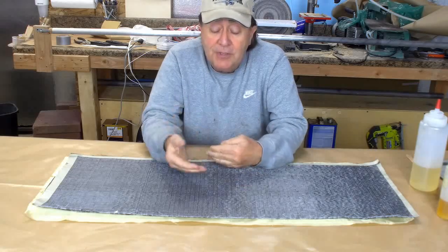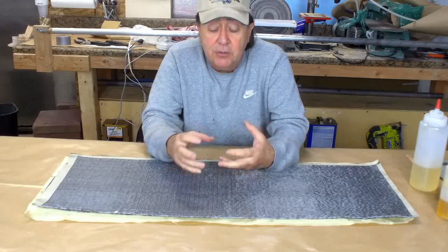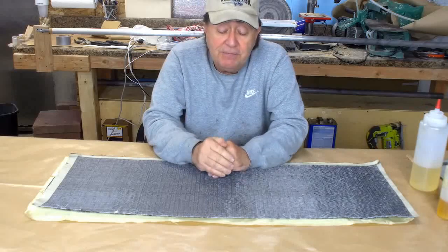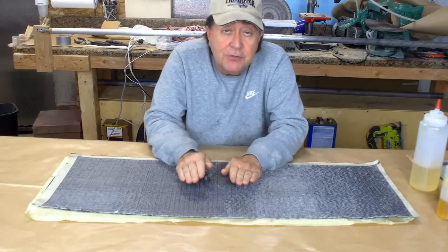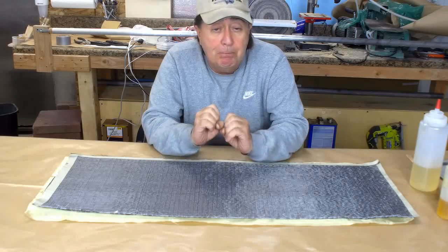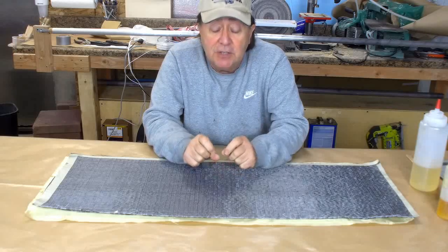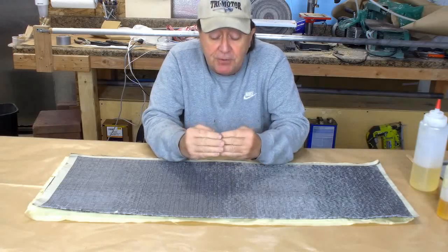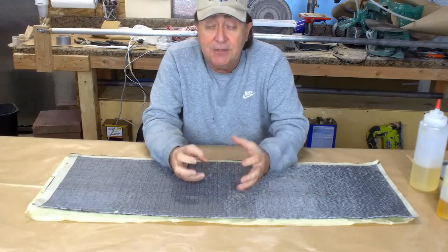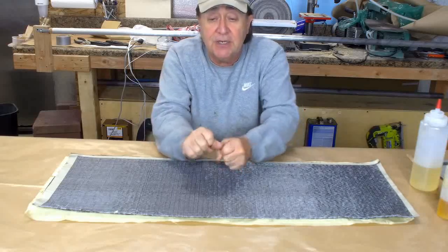When you wrap it in Kevlar, you've essentially put a bulletproof vest around the carbon fiber, and hold those shards together, and it doesn't fail in the same way. As a matter of fact, because of the dissimilar nature of the two materials, rather than just getting a catastrophic explosion type failure, which is how carbon fiber fails, you'll actually get some delamination first, the carbon fibers will be breaking inside the matrix, and the Kevlar is still holding together, and you just get kind of a mushy part.